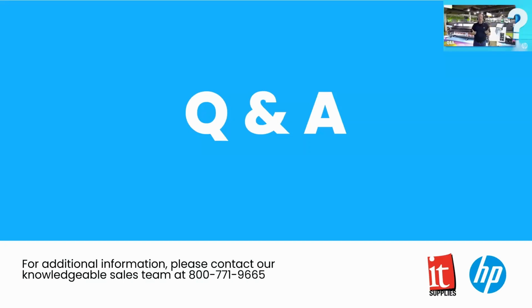There's an application for both. There's an argument for which one you want to use. Now, I have some customers that will print to a treated fabric that is coated for latex. You kind of alluded to that in your question. It gives it better scratch resistance. Because of that, if you use one of those products, it will probably in certain conditions not fade as fast, because our fading doesn't come from true pigment fading or dye fading. It comes from pigment being released. The coated fabrics tend to grip onto the ink a little better and hold it on the surface so that you don't get fading as quickly. Basically, it's the release of that pigment coming off of the media surface. I hope that answered the question. If not, put another one in the Q&A.